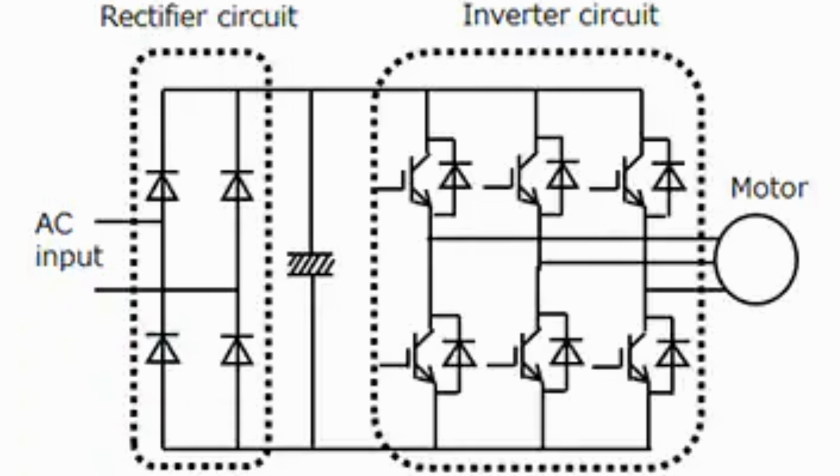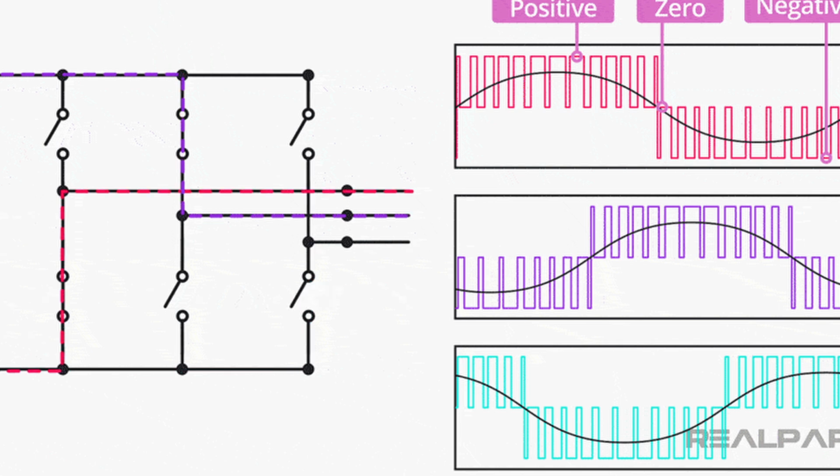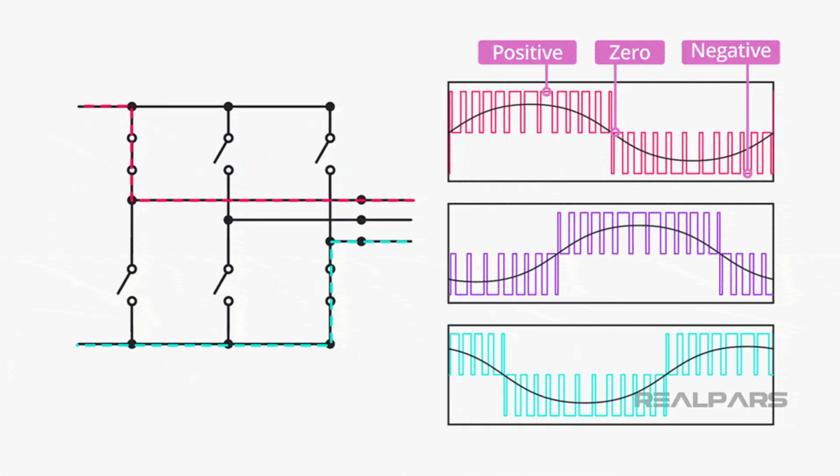So with that, we have gates. Those gates essentially act as coils. So we have to trigger those gates to activate the transistors internally. And the transistors are turned opposite to each other, hence the bipolar part. So what's happening is we can fire one transistor and we get a positive DC voltage output. Then we have to close that transistor and fire the other one to get a negative pulse output. And when you graph that on a sine wave, it literally is kind of this blocky stair step. Now technology's gotten better, so it looks a lot smoother than it used to, but it's all still the same basic theory.